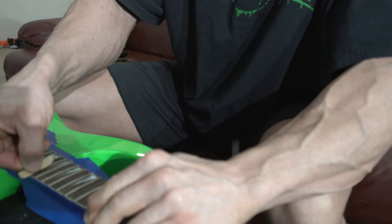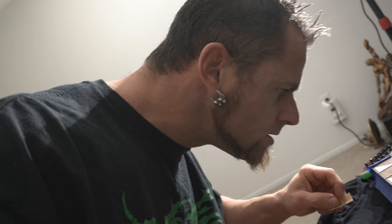Just about finished with the sanding process. Next step is hitting the fretboard with mineral spirits to clean everything off. I like to vacuum everything up first before applying the mineral spirits. Before I move on I want to go over the whole board carefully and make sure I didn't miss anything — any shiny spots get a quick light pass.